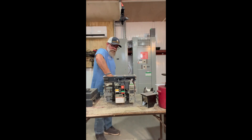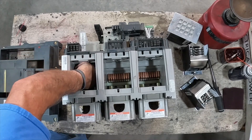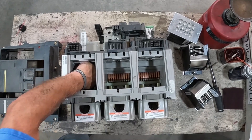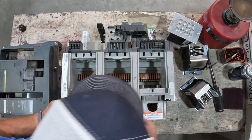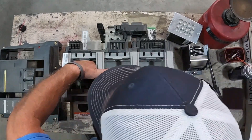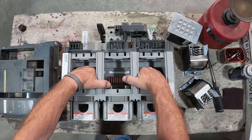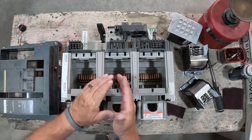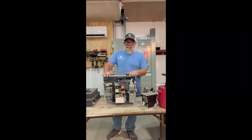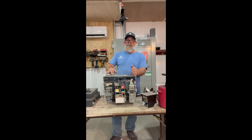When we do this, you really want to get a good visual inside the contact assembly to make sure nothing's out of whack. A big part of this is just a visual inspection — looking down to see if there are no deep pits, no arcing, nothing out of order, nothing loose on the frame of your main contact assembly. You can wiggle that by hand and see that it all travels together, so nothing's out of alignment.